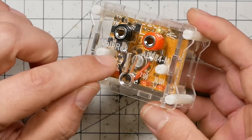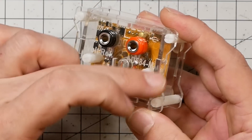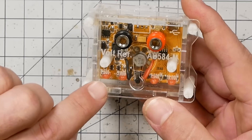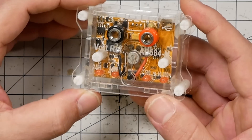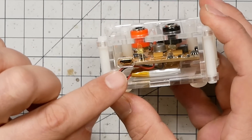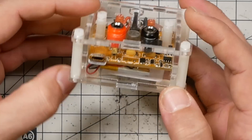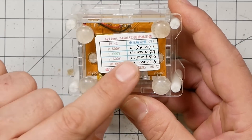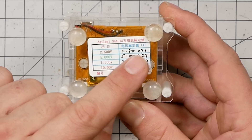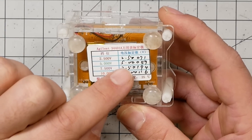This device takes one of those voltage reference chips and puts it on a circuit board for convenience. The chip itself is about three bucks, but this is around 20 bucks, and I think it's worth it. It's variable — it can do 2.5, 5, 7.5, and 10 volt reference outputs. It has a built-in single-cell LiPo and a USB port so you can charge it and use it in the field. K-Moon have used a super precise multimeter and written the actual measured values on a sticker on the back, so my 5-volt reference is actually 5.00049. That's a lot of precision, and I know that exactly.